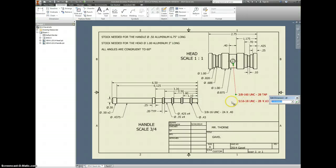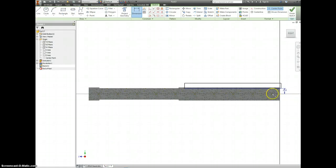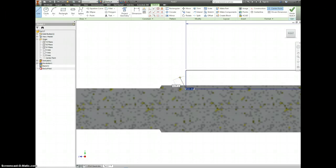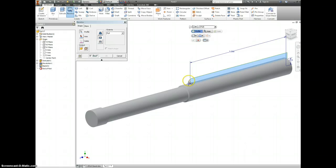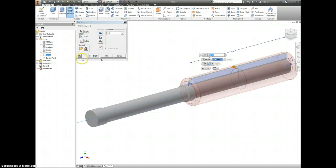let's double check our measurements here. We said this is 0.425, so 0.425 divided by 2. So now we have the height of that. It comes all the way over to 3.2. Yeah, that'll work. And this is still going to have a cutting bit on it. And that has that 30-degree angle, so we can tab and take that into 30. Connect it back up top. Finish your sketch. Revolve. Cut. Click both profiles. Axis is the Z-axis. Select OK.